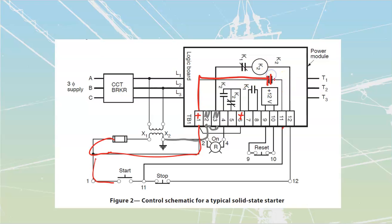Looking at this, when I press start it's going to provide power through the circuit. We see that power is being placed in parallel — is this correct? Absolutely not. They screwed up their own drawings here, otherwise some of you would twist yourselves in circles trying to sort it out. What we see is that as drawn, pressing start feeds power up but there's no place to go because that contact would be sitting open. They've interchanged the start and stop buttons — the stop is always in line, and the start is downstream from that.